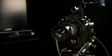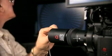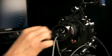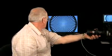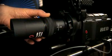Lock it down. Use the provided cord — in this case the red one — plug it in, turn on the diascope, and adjust the contrast. In this case that's good for my eye. Then you focus the diascope until you get a nice and clear image in the center.